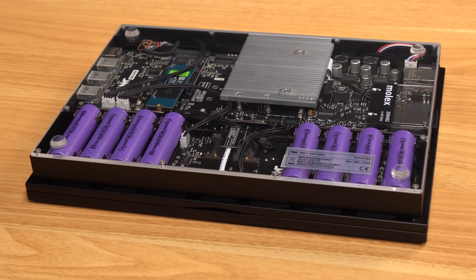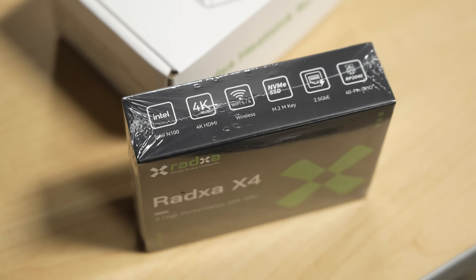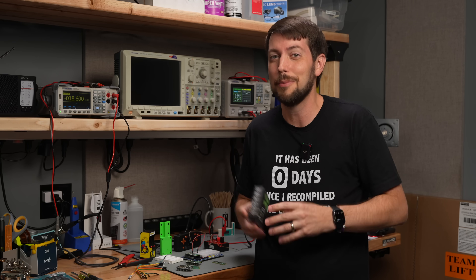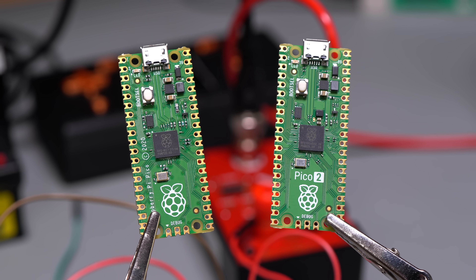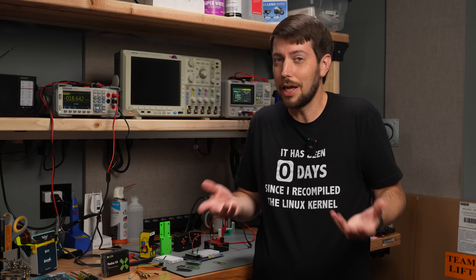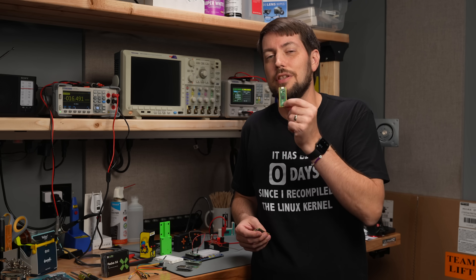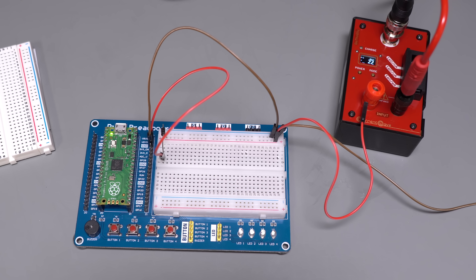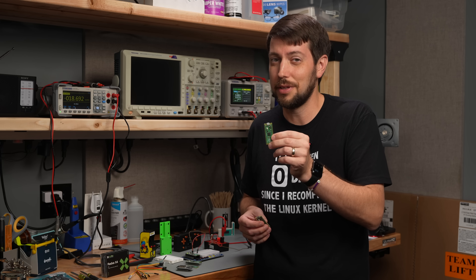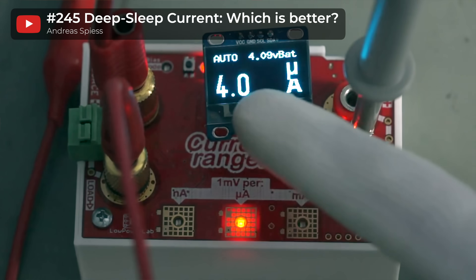And that's before we get into places where you might never notice there's an RP2040 hiding. Like the MNT Reform I tested earlier this year — the trackball is run on a 2040. And the Radxa X4 has a crazy combo of an Intel N100 with an RP2040 to make one of the first x86 SBCs with full GPIO support. Raspberry Pi knocked the RP2040 and the original Pico out of the park, and it really introduced microcontrollers to a lot of people who never got into them before. But it wasn't without its flaws — one of the main ones was power consumption. The Pico doesn't deep sleep down to the microamp range; the best I could find is around 1 milliamp, and my own test with MicroPython shows it going down to 2 milliamps. This ESP32 can get down to 5 microamps in deep sleep, meaning battery life could be measured in months instead of days or weeks.